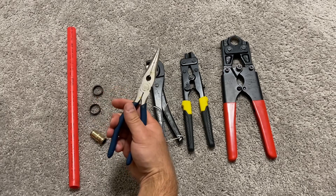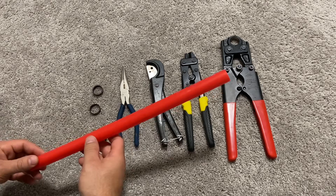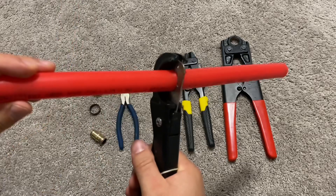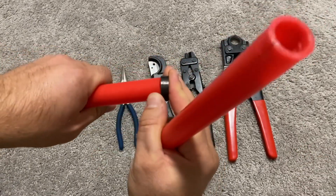These are regular needle nose pliers, our three-quarters inch PEX tube coupling fitting, and two copper rings. First I will cut the tube in the middle and make a connection as if these are two different pipes. First we put copper rings on the tube.